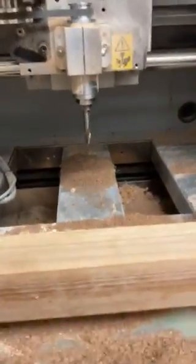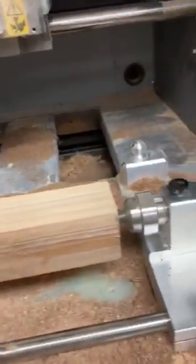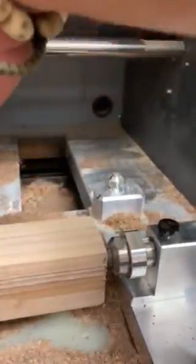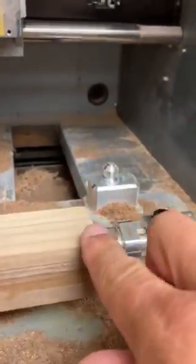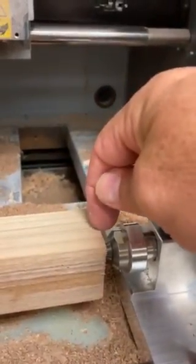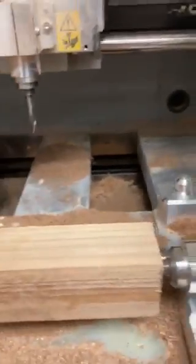We're ready to find the origin of our blank. The origin for all cutting is right here — it's the dividing line, the mid-line, and it's one paper thickness above the blank. So right there is going to be our origin. Once we tell the machine that, we're ready to go. Let's come over to the v-panel.